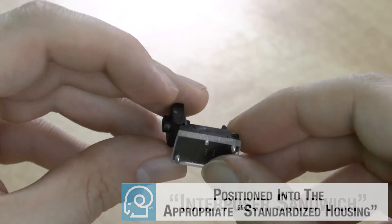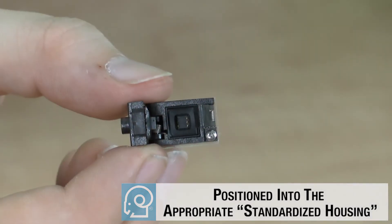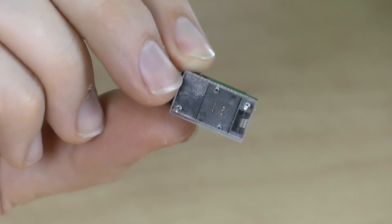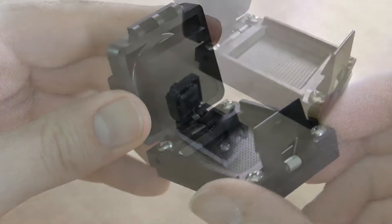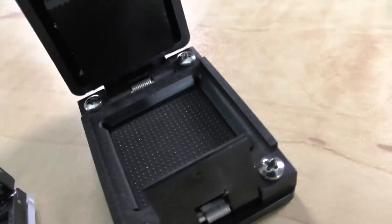The completed CIP is inserted into the bottom side of the base or housing that has had the device guide opening machined into it. The device guide opening accurately locates and positions the device contact points, solder balls, pads, or formed leads with the spring probe locations in the CIP. Replacement CIPs are easily interchanged when an existing CIP is worn out or in need of repair.